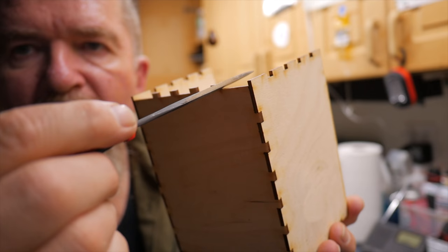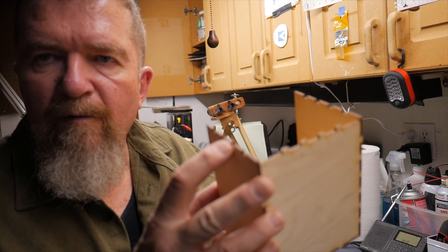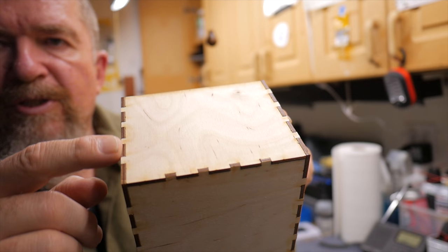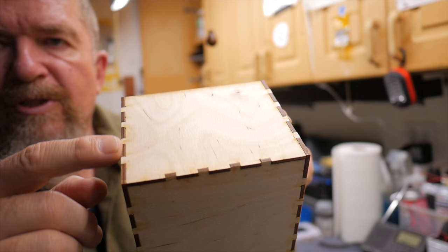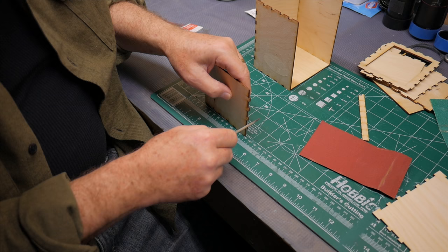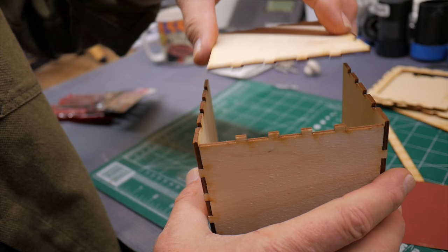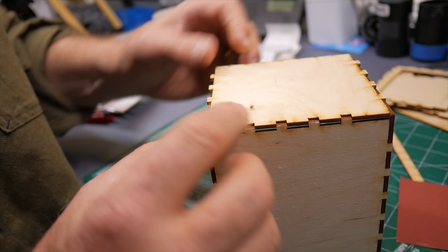The sides of this file are about perfect for getting in there and filing down each side of the notches. The idea is not to take the wood down too much — just to get the char off the surface of the joinery where the laser cut it, which should ensure a nice snug fit. I filed down the notches on both sides of the side piece and the notches sticking out on the back lid, and then the piece fit on just nicely. Now I'm going to start filing down these surfaces on the other side piece.